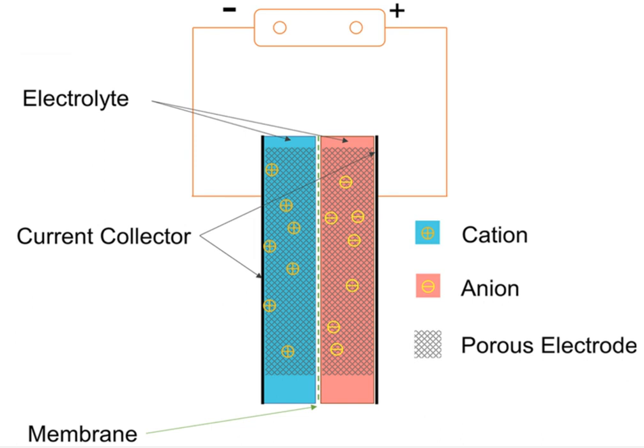Device capacitance and resistance dependence on operating voltage and temperature. Device parameters such as capacitance, initial resistance and steady-state resistance are not constant but are variable and dependent on the device's operating voltage. Device capacitance will have a measurable increase as the operating voltage increases. For example, a 100 F device can be seen to vary 26% from its maximum capacitance over its entire operational voltage range. Similar dependence on operating voltage is seen in steady-state resistance (R_SS) and initial resistance (R_E).